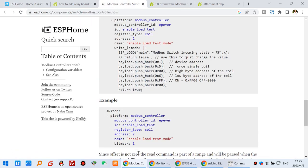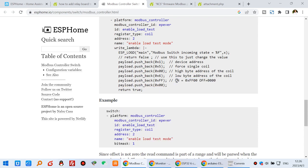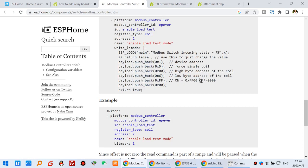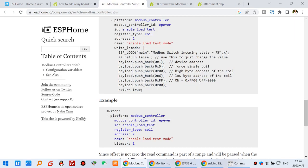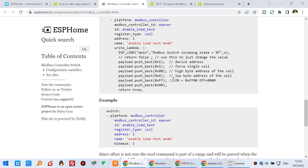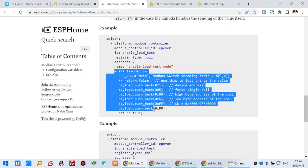This is the Modbus — this is the easiest example I have created. But if your protocol is not like this, and the on command and off command are in a different format, this is the default for ESPHome. You can use this command very easily because our protocol on is FF00 and off is 0000. We have designed this board according to ESPHome so it integrates very easily. But don't worry if your board uses a different command — you can send a custom command by this way.